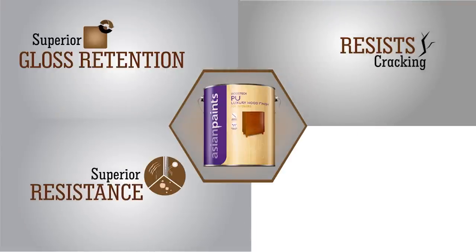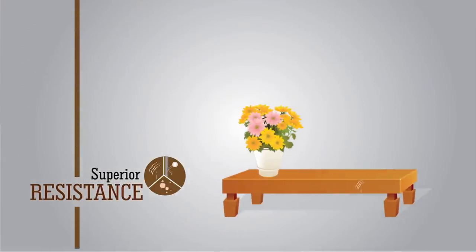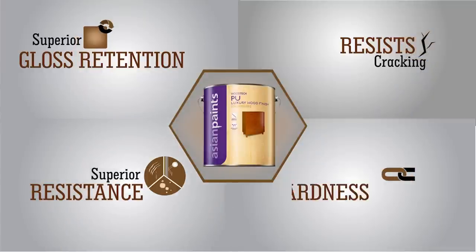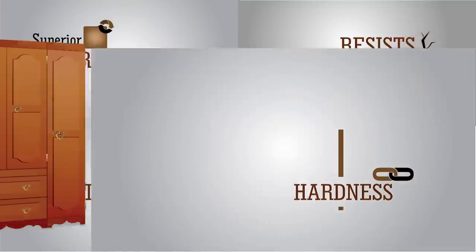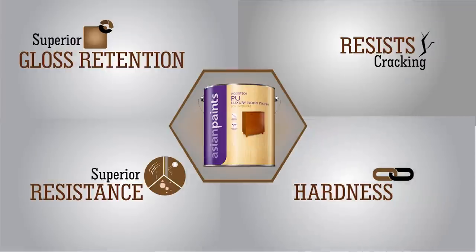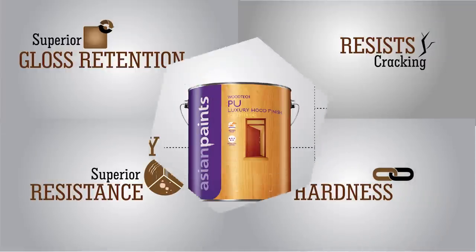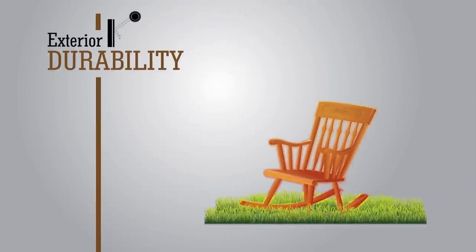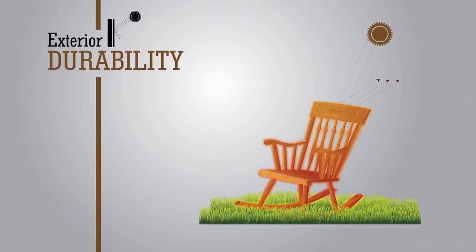Superior resistance. Asian Paints PU for interior has good scratch, stain, and heat resistance. Hardness. Asian Paints PU has superior film hardness, making the product more durable as compared to melamine. In addition to these features, Asian Paints Woodtech PU exterior has exterior durability. Asian Paints PU exterior has UV guards, which make the product an excellent product for exteriors.